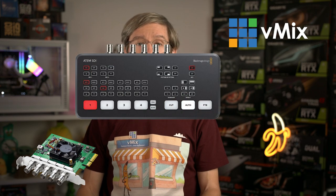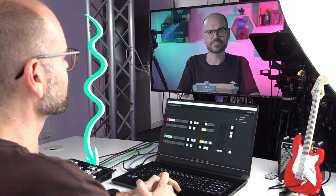Okay, now on to the demo. Today we're going to be using the Blackmagic Decklink Duo 2 installed in our studio PC here, Constance. We'll be taking the key and fill out from this card via SDI and sending it to our ATEM SDI in front of Heath. Now the Quad 2 and the Duo 2 require you to make an adjustment in the Blackmagic Desktop Video utility for key and fill to work.